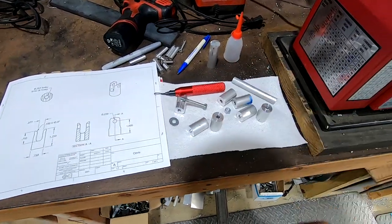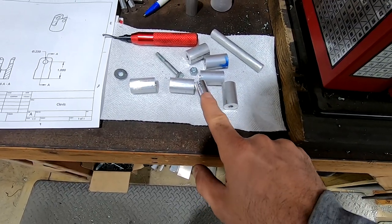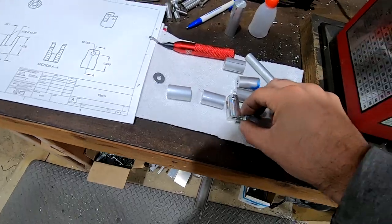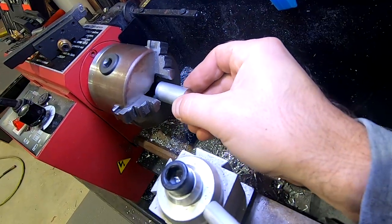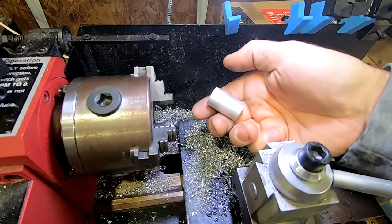We're running into my first problem with these things. My original plan was to turn them down to get a nice machined finish on the outside, running a bolt through the center with a nut on the end keeping it all tight. But that setup was giving me a ton of wobble. So this is one of those cases where I think I need to make a fixture just to hold it — probably turn down a large chunk in the three-jaw. This wouldn't be an issue if the through hole were big enough, because then I could have faced the end, turned the side, and parted it off to exact length. One of the limitations of these little mini lathes.